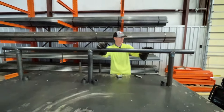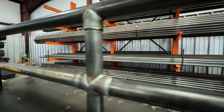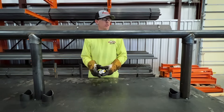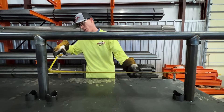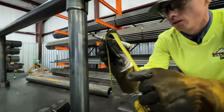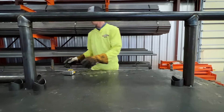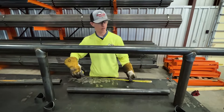So I just threw this top rail on real quick, got it all welded, and now I'm going to show you how to do these rails. So just like the top rail, we're going to use these Pipe Pals as the sleeves — as the notch pieces. Really what you got to do is measure in between your posts: 37 inches. And you want to take off a half inch to an inch. I went half inch, so I got my piece pre-cut already. So step one for your cross rail, you're going to want to get your measurement — we cut that down already for a rail.